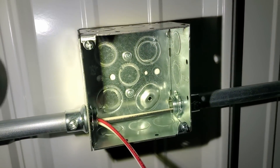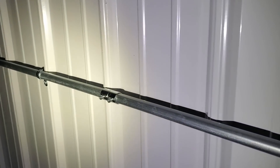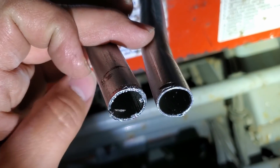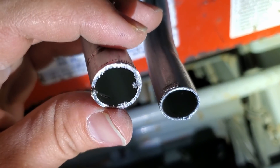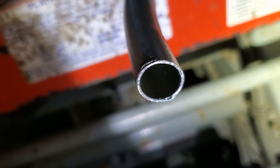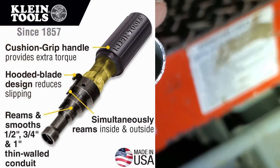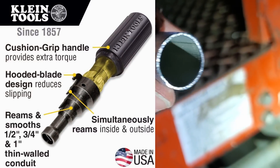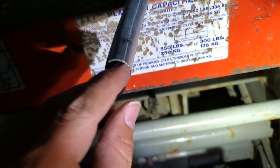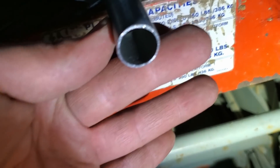As you can see, I've used a couple screws in each box to hold the box in place to the structure. Whenever you make a cut, before you put your fittings together, you need to deburr the end of each piece of EMT. This one on the left has not been deburred, and the one on the right has been deburred. I'll put a link to the deburring tool in the description and also put a picture of it on screen. You need to make sure those are nice and clean — you shouldn't be able to reach in and get cut by it, because if you can get cut by it, the insulation on the wire could definitely be subject to damage.